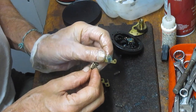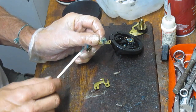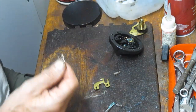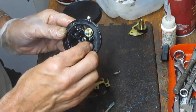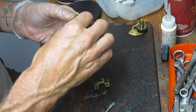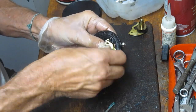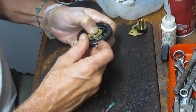We have the spool bearing. Make sure all the teeth in the spool gear are clean and not chipped or bent in any way that would be a problem for performance. You'll notice there's a slot in the spool gear — that slot is going to sit on top of the spool so it faces out. We're set up to reassemble. Simply put a spring in each corner in the recessed holes, reversing the process of how we took it out — two springs, a yoke assembly, and the jack. Just checking operation, and that's how we found it.